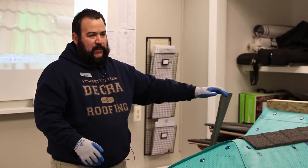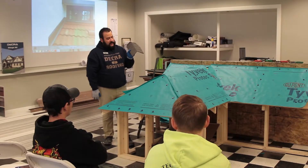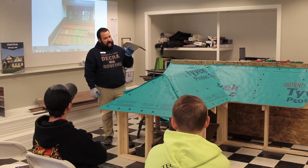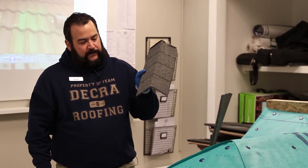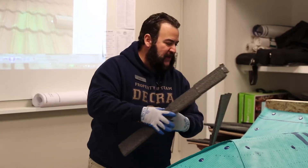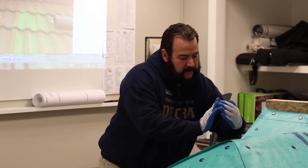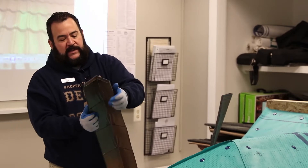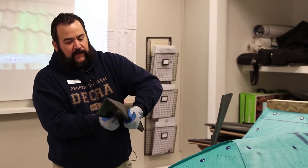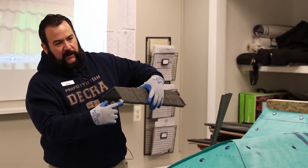So it's just another option to keep in mind as you're working through this roof. I've been doing this a long time, and since day one I've been arguing for a wider, larger cap — not only for coverage purposes, but when you get into a steeper slope, these peak out higher. By the time you cut your plywood back, you're going to have to form fit this cap to fit the pitch of your roof. When you start getting into a 12-12, look at how narrow we are.